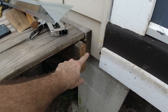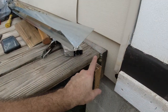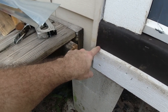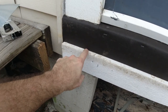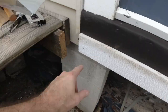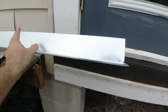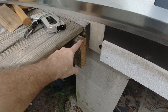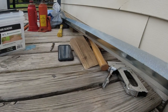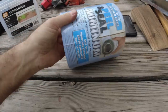We hung this white board here — it's level with the surrounding area. My idea is it's going to continue all the way there as part of the deck, and the deck boards are going to sit on top of it. Next I need to put this board in to see if it's going to sit on that board the way I planned — that's what I want to have happen. Then I'll use peel-and-seal flashing to cover it all the way.